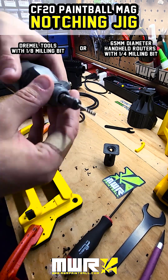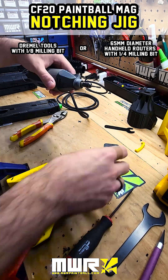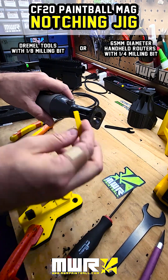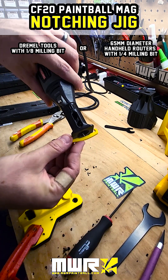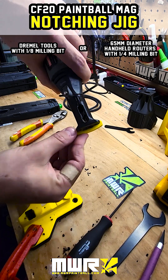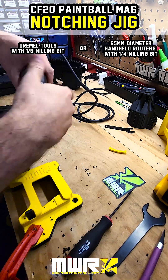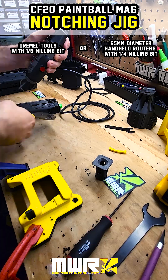The bit I own is a bit different — I'm not sure exactly where it's from, some kind of kit I had, and it's not great, so I suspect the Amazon one will do a better job. You have to remove the little cap on the Dremel to add on the adapter, then loosely put on the fluted bit and put on the bracket. We want to loosely put the bit so we can adjust the depth at this point using the depth guide — push on that until the depth guide won't go any further, and the bit will be at the right depth. Then remove the bracket again just to tighten the chuck on the Dremel.